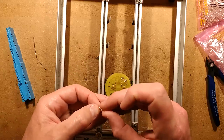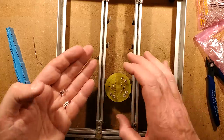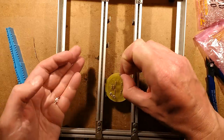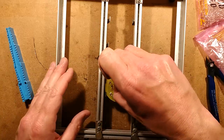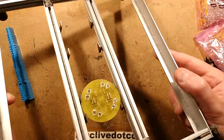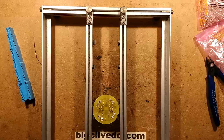In the previous circuit boards, all the LEDs were biased with the positive connection going to the top, but it was easier in the case of this design and more compact to have the positive on the outside as one circular track going around all the LEDs. And no matter how much effort you take, sometimes you do screw up. It's just part and parcel of doing electronic assembly. People make mistakes. It's just ours tend to be louder and involve smoke and flames.